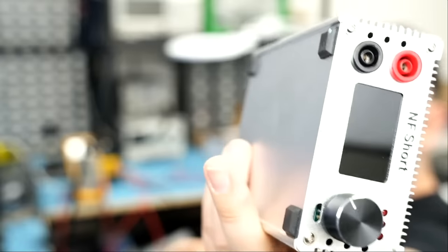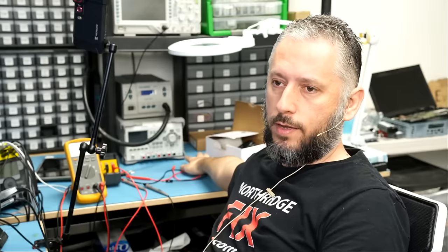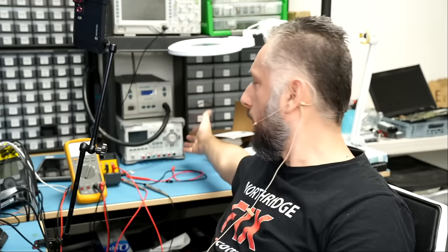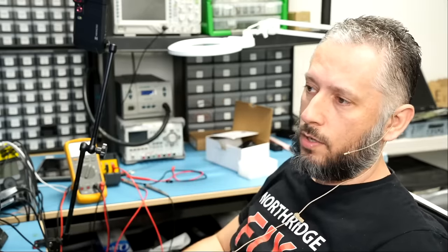So this voltage injection tool can handle a short. Another thing is a lot of power supplies will not even allow you to inject voltage when a short circuit is detected, and they go into protection mode to prevent damage to the unit, like what happened here. I injected voltage using the third channel and now the third channel does not work. Or it does work, but if I have the power supply set at 5 volts, the third channel will output something like 0.5 volts or 0.9 volts or 0.7 volts. And now I'm not able to use channel number 3 because I injected voltage onto a short circuit.